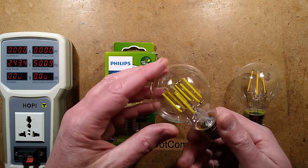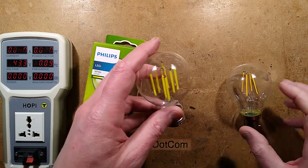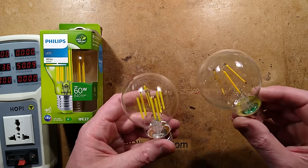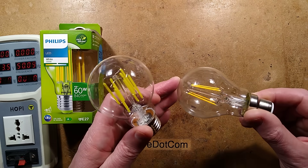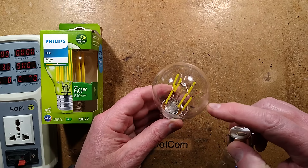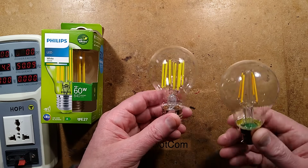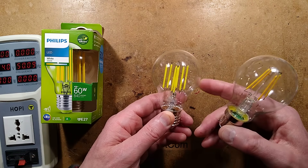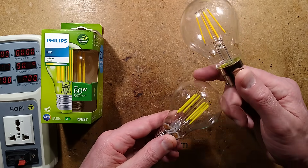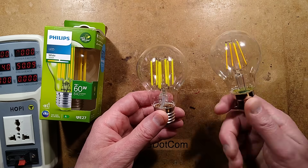They created him custom lamps in 1, 2, and 3 watt ratings. This is the 2 watt rating. For those of you who said you've had those locally at the supermarket for ages — this is the one you have. It's got 4 filaments, it's 4 watts. This one is actually brighter: it's got 8 filaments and is rated 2 watts. So basically 4 filaments per watt versus 1 filament per watt, and underrunning the LEDs and the choice of phosphor makes this much more efficient than this.